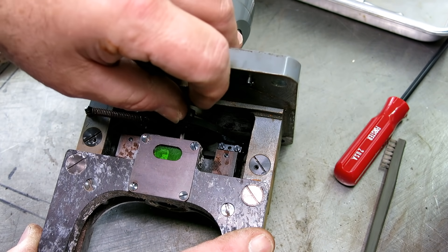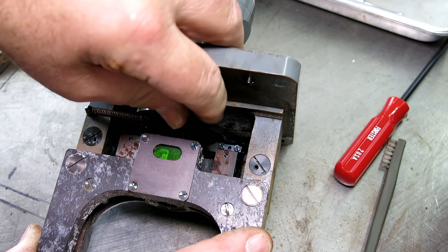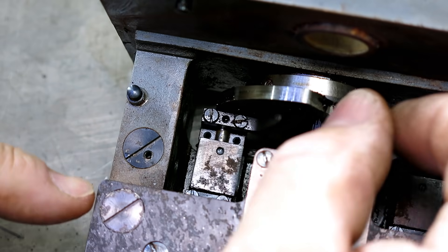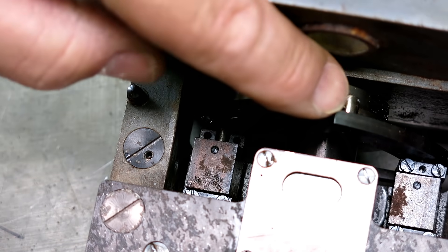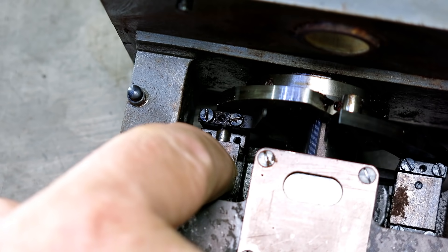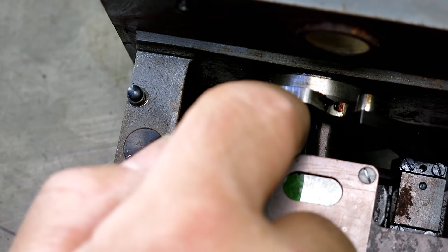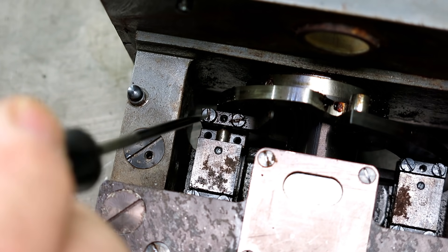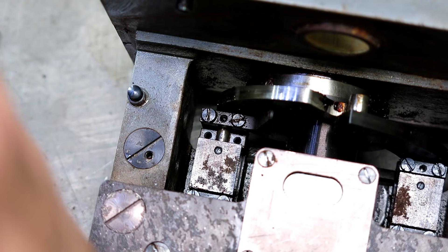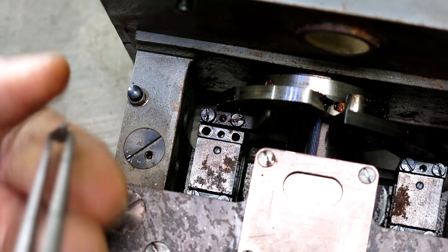I'm not going to take this apart — I'm going to try to get it freed up so maybe we can stick it back in and get a better look at the fine division scale. I found the bit that was jammed — you can see now how it's supposed to operate. These pivots now work. Whatever alignment was between this optical element and this has been lost because the actuation arm swiveled on this shaft, so the relationship is gone. I'm just going to put it back together and tune it — look at these beautiful little Fillister head screws.